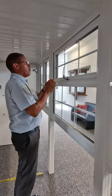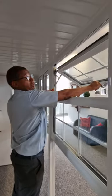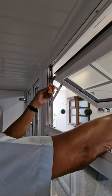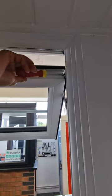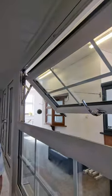Open the window and you'll see on the plastic section of the hinge a little brass grub screw. Turn that in a quarter of a turn, half a turn, full turn, whatever it needs. Same on both sides — get it in the slot, you've got about half a turn. That's added friction so the window will stop open in normal conditions.